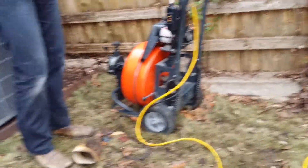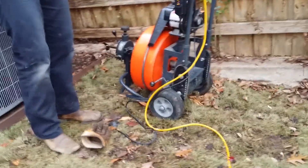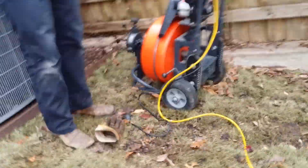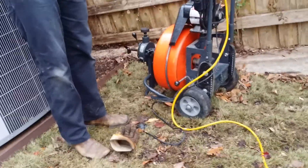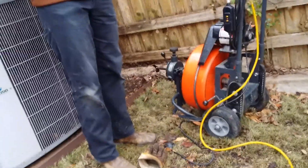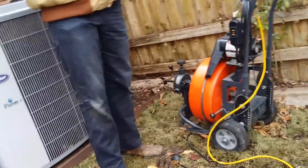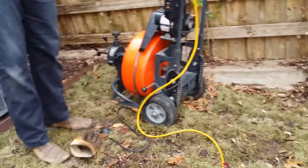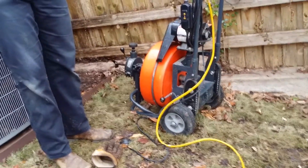Every time I've taken off the drain of that shower, I can see water holding there and it really shouldn't be, should it — in a shower? No, the shower is supposed to have its P-trap. Everything is supposed to have a P-trap, now whether they put one in or not. Water is always supposed to be in a P-trap because it prevents the sewer gases from coming back into the house.